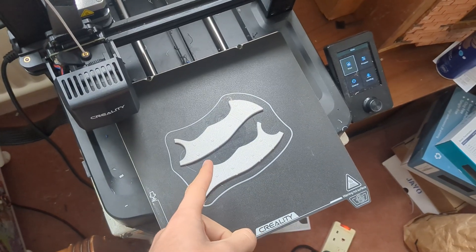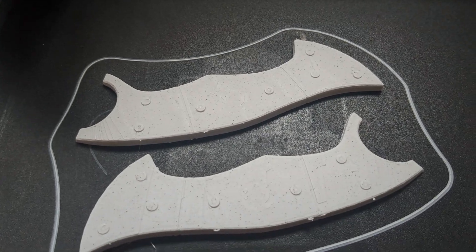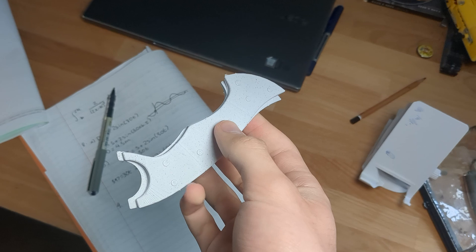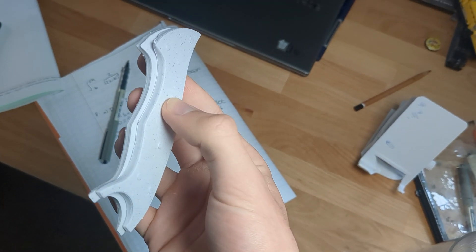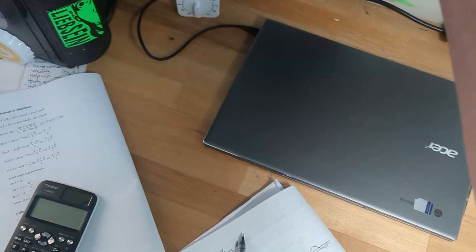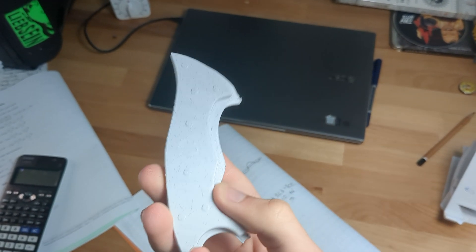12 hours later, this one is looking good. You can kind of see the little black specks — that's the marble PLA look. Upon closer inspection, it seems like these didn't come out as well as I'd hoped. As you can see, it's peeled off at the corners. So I've put a brim on and I'm going to start that printing again, hopefully it will come out a bit nicer.